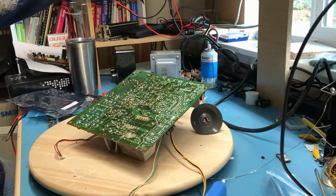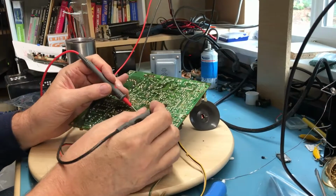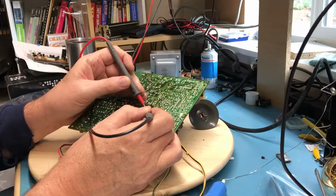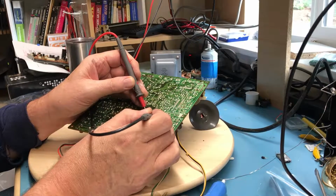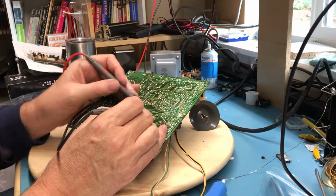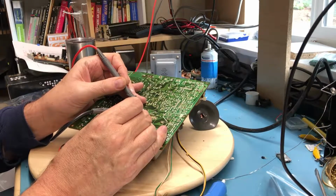And we can go ahead and do that again. Let me get the test leads here. And ohms. And if I look at the leads on this guy that are actually hooked up, I find 0.052 ohms there, 0.28, and I got good contact here, and 0.38 ohms. So there's definitely something going on here on that side. These other pins are just completely isolated. 67 meg. And if I look at these other pins in a continuity kind of mode, there's just nothing there.